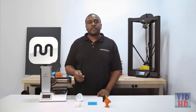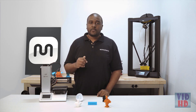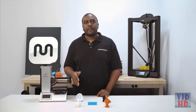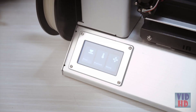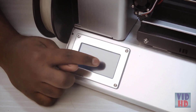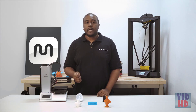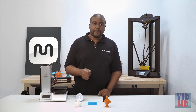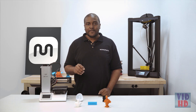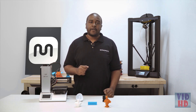Out of the box, the unit is ready to print — you will just want to run the new auto leveling function first to do so. Plug in the unit and navigate to the move menu where you will have all of the axis move functions. In the Z axis menu there is a center sub-menu to access the auto bed leveling settings. This will display the currently set Z axis offset which, out of the box, should not need to be modified.